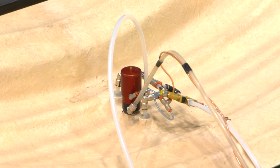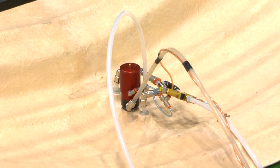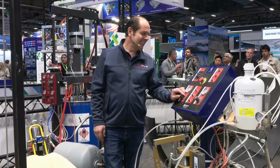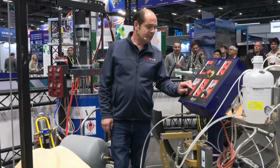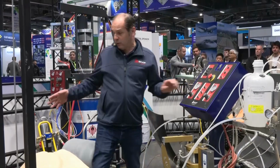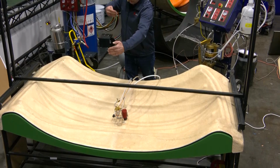Don't try to see anything, you see nothing. The countermold is closed, there is resin and composite inside, so I'm sorry, it's not very attractive, but it works. We have already injected half, 1 minute. Now the resin flows first on the resin channel because I create the pressure, and now it's moving on the box side.